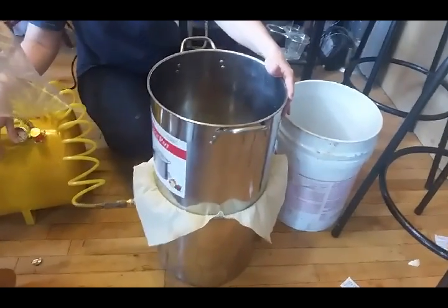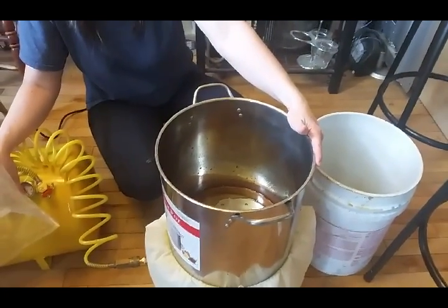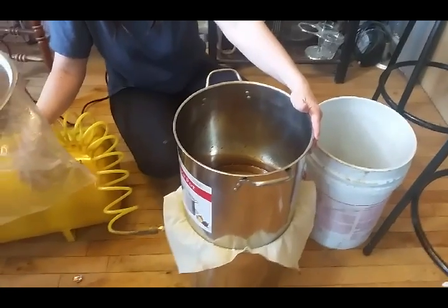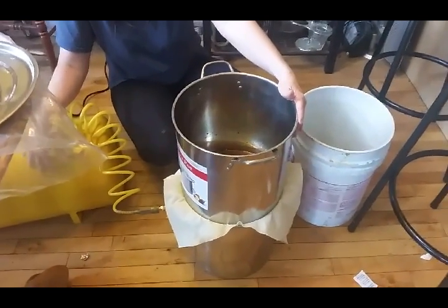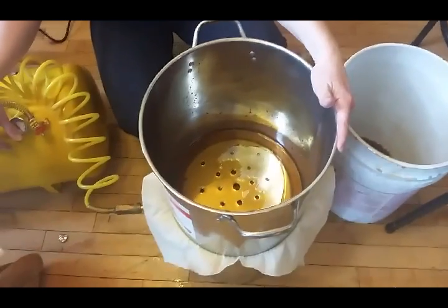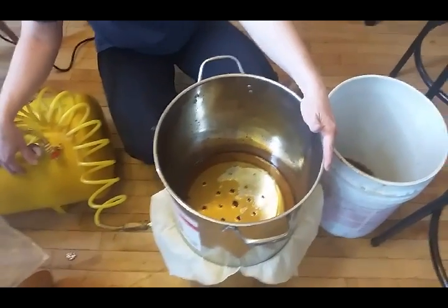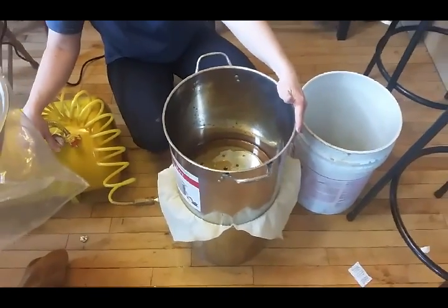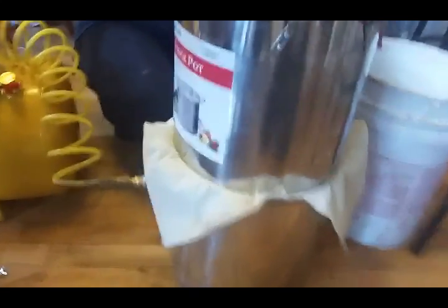So in theory, what you do is you fill this pot. We were filling it up about 1/3 of the way, because at the end of the season we were getting what they call dark or dirty syrup out of our pans. So you fill it up, it covers those holes, and it gets to the point where it's thick and dark and it doesn't drain down in. So then what we do is we've got a little 1/4 turn shutoff, which you can't see yet.